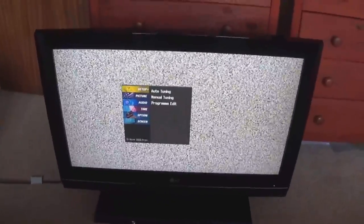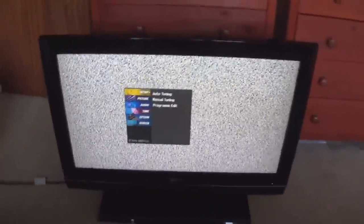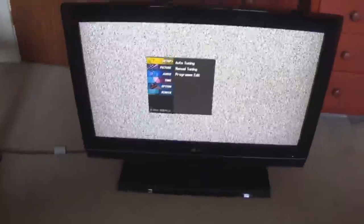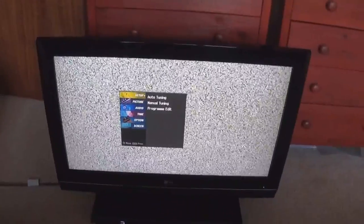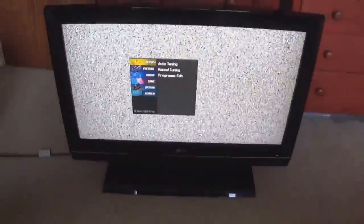I have a suspicion that those caps weren't a bad series and failed because of the power supply, because the caps on the power supply originally were at fault. When caps fail they don't filter out the ripple current on a voltage rail, so I think the ripple current coming off the failed caps on the power supply eventually just overloaded the ones on the main board, because they end up taking all the load, and just caused them to fail.